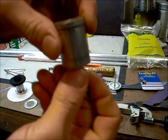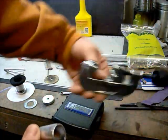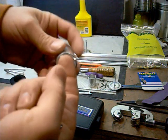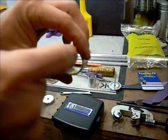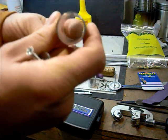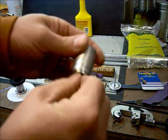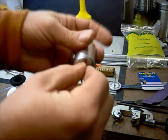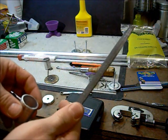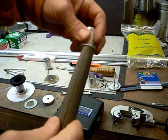The trick to keeping it from sliding out is when you cut your tube you have to cut it with a pipe cutter like this, because what a pipe cutter does is bite into the tube causing a little flange on the inner side as you cut. That means the washer won't fit into the flanged end, so I use a rounded file to open up one side of the flange.